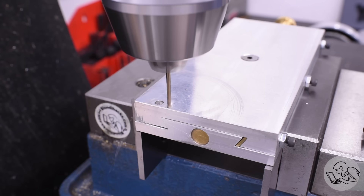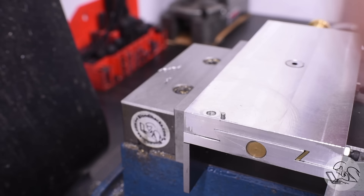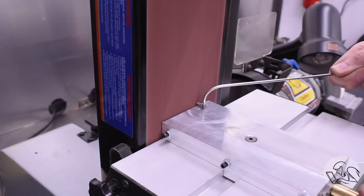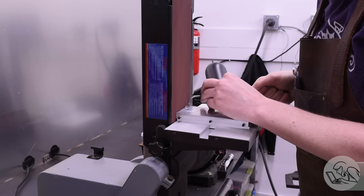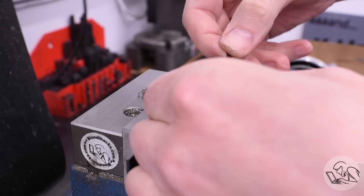The final operation is rounding the ends of each piece. For that I'm adding a new pin to my end-rounding fixture — I drill a new hole the same diameter as the ones in the plates, then make a little pin on the lathe to fit, and this lets me swing these pieces over on the belt sander to round the ends. I'm really pleased with this fixture. The dovetail slide gives really nice control, and I can use a poker to keep my hands away from the belt when rounding very small pieces. I can run through both ends of all six pieces extremely quickly with great results. It's not completely repeatable — this is more of an aesthetic corner rounding — but for pieces this small a rotary table fixture would be a lot of unnecessary work.